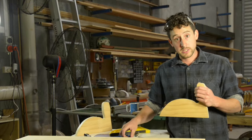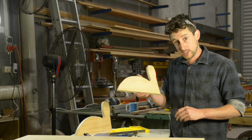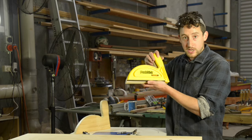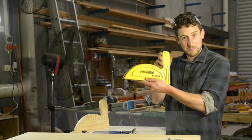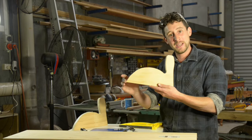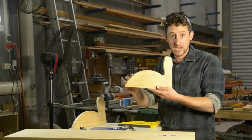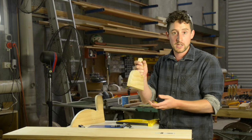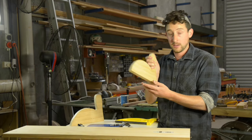To demonstrate the way that I use these flush trimming bits, I decided to create myself a few push sticks out of timber. First, I traced my template from one that I bought earlier from Timbercon, and then I cut that out with a bandsaw as neatly as I can. You have to be careful, it's a little bit slower. I then sanded the whole thing so it feels like the piece that I want to ultimately end up with.